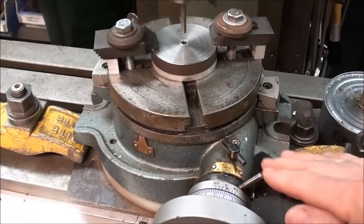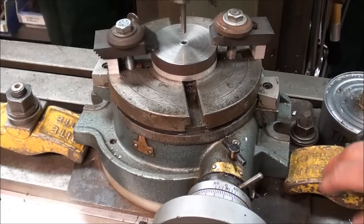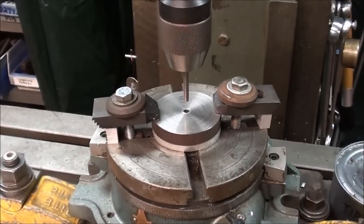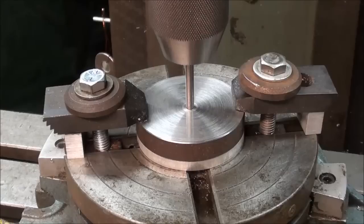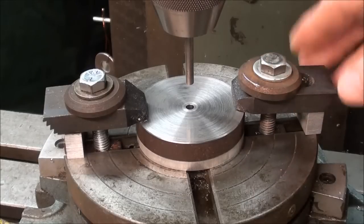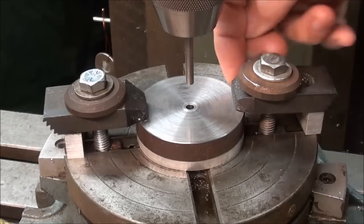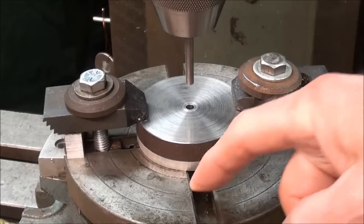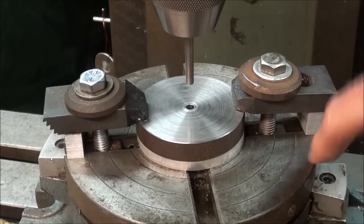I had to add two toe clamps to this steel plate, which was warped — it wasn't true and there was some flexing going on. It wasn't sitting flat on the milling machine table, so it's clamped with two yellow clamps and two other bolts, which should be more than secure enough. The work is also clamped down to the rotary table; it's centered, and the digital readout is still on center. Finding the right clamps was no small job — I needed clamps small enough to fit on the table and not interfere with where I'm going to drill. These are rather stubby 3/8ths bolts with T-bolts that fit the metric slots, with plenty of room to do my drilling.